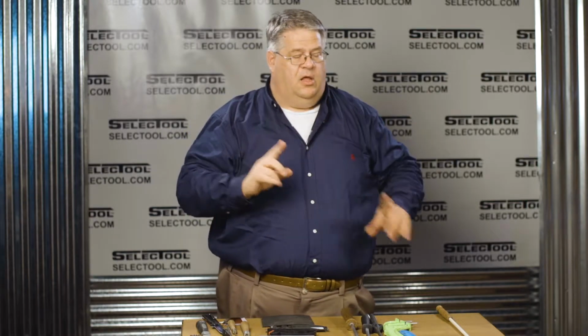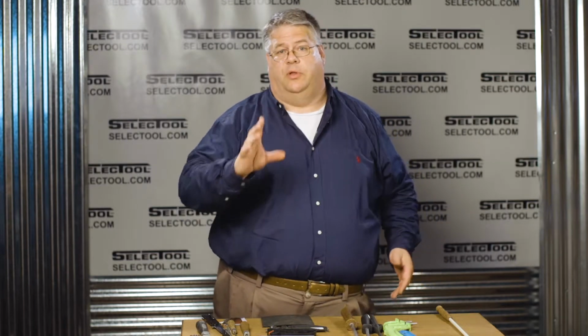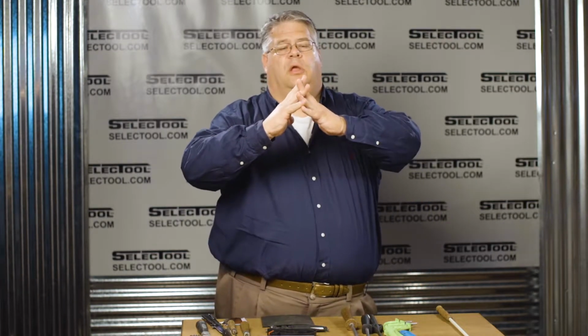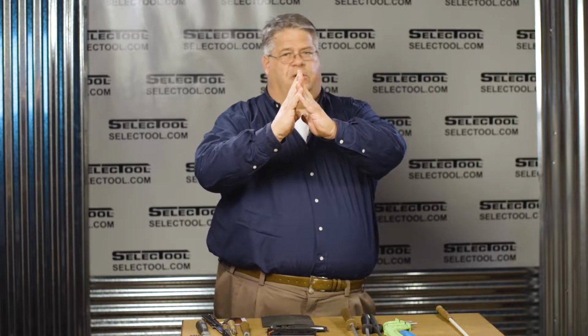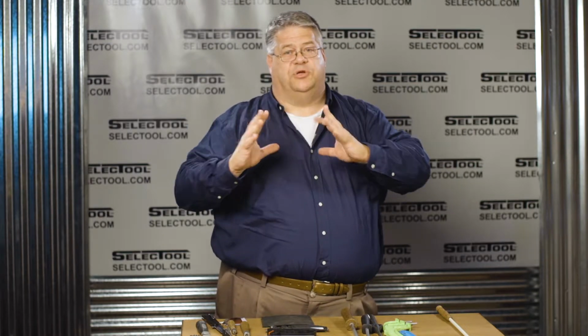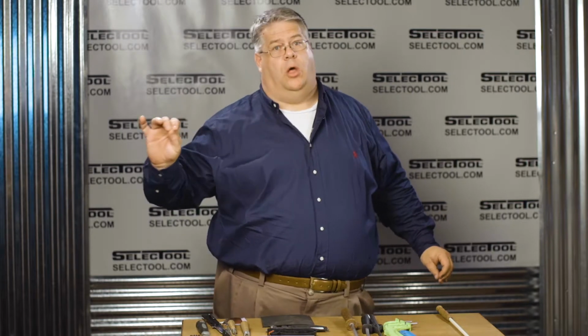And then, if you want to use the diamond hone, or the diamond rod, or the ceramic, or the Arkansas whetstone, when the edge has been straightened, and that edge is looking just like that, you can use the ceramic to remove the little tiny remnant. That will keep that edge nice and clean, nice and tight. You're not taking off any more metal than you need to. You're not wearing it down, you're not flattening it prematurely. You're simply using that the way it's designed to be used. It's going to work much better. It's going to last much longer.